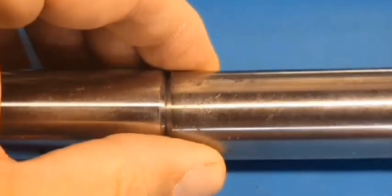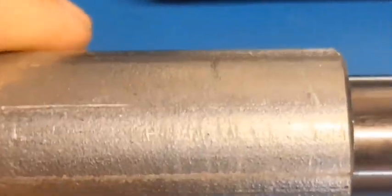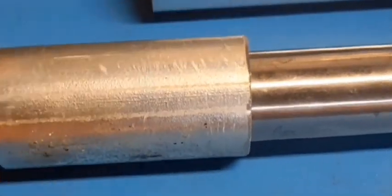Once we remove this, the pieces can butt together. I've already beveled this so that I can weld it. Once that's welded, I'm actually going to put a collar over it. This is the collar I'm going to use — it will slide through here and then slide through this other piece. Once that's welded together, I slide it across and then weld it at both ends, which should strengthen it really well.